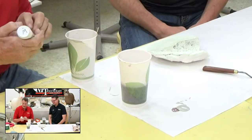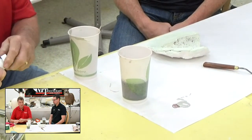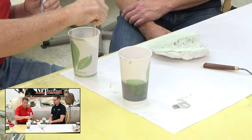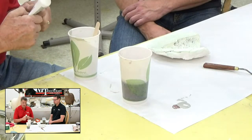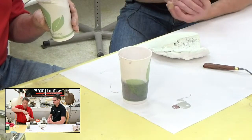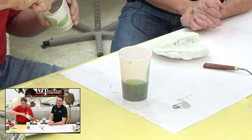That's okay. Okay, now cream hardener, 1 inch per golf ball of the putty. That's for body shop applications when you're trying to smooth and you need some time and you've got to feather it out. We want a little bit of speed here, especially because we're against the clock in our little 1-hour presentation. So I'm going to put in more than an inch. I probably put in 5 or 6 inches. That's a lot. But I've seen you rotate a mold before, and you're fast. We could be at it all day.